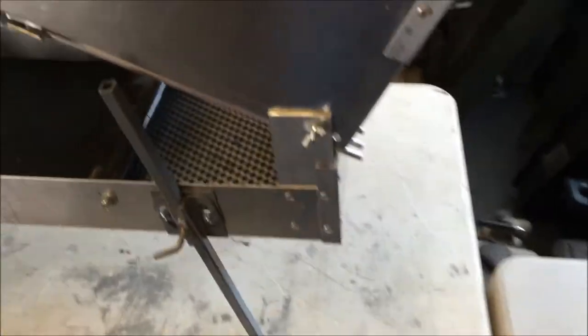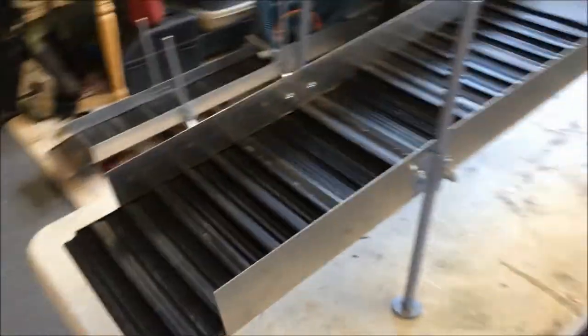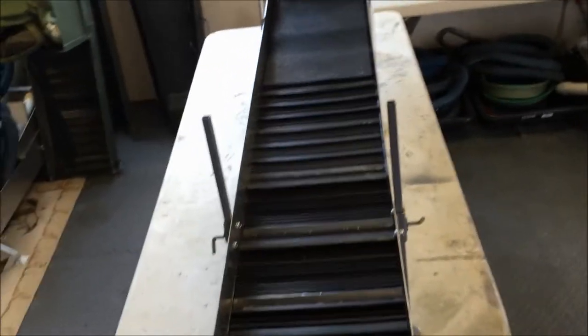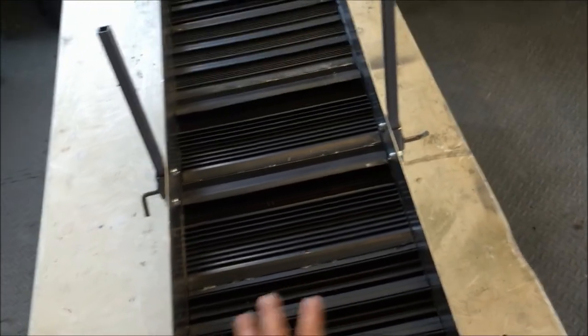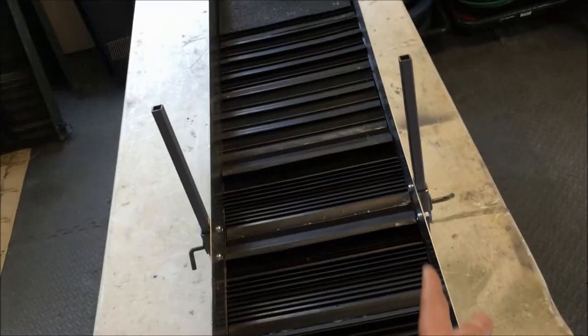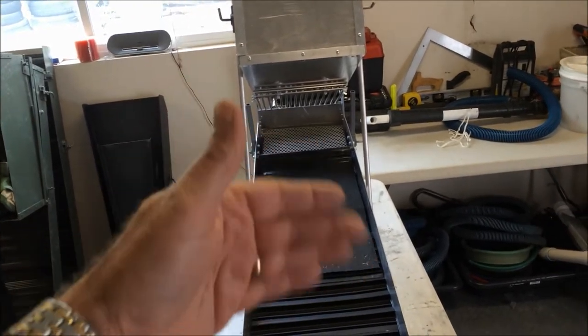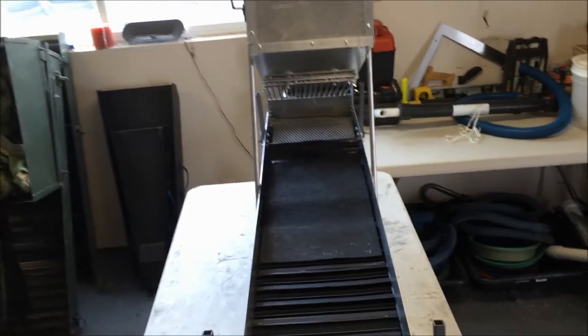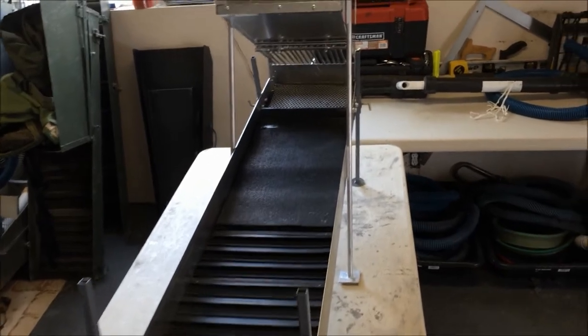On the backside of the high banker, the backstop is four inches high. I had the materials distributor form my sluice box. It's 60 inches long — five feet long. I had them make the bed 10 inches wide, and then the sides I had them break and bend to three inch sides. The back part though is all one piece and it's four inches high. I just put it all together. It didn't take me very long at all because I had most of the parts here already.